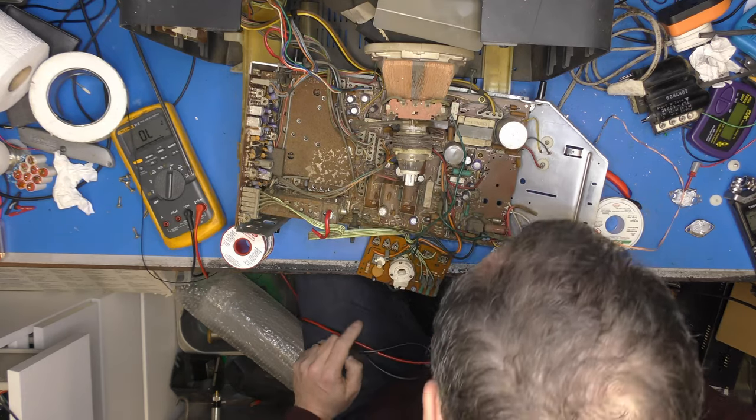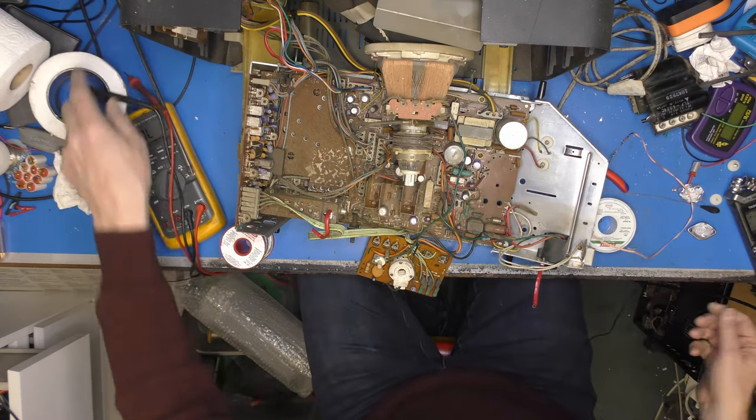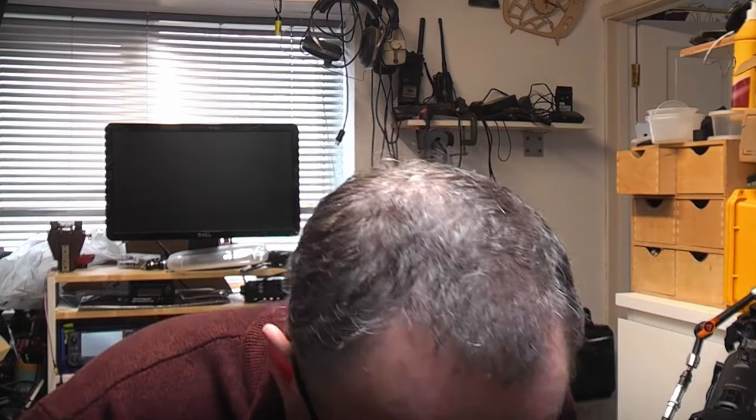And they're all fine and dandy, which is good news. Right, so I think the next thing to do is work out where our power supply comes into our line output transformer. Generally, the line output transformer has a winding. You've got HT or a B plus in this case at one end, then a winding, then it's the transistor